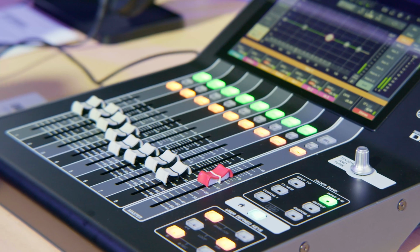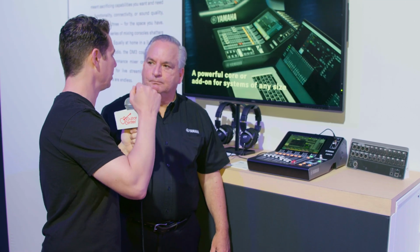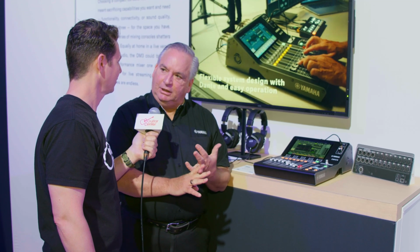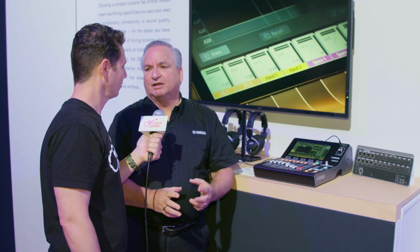And so, what are we dealing with in terms of the key stats on numbers of mixers, numbers of sub-mixes, numbers of effects, things like that? That's pretty easy on this guy. It's 22 total inputs. We're counting 2 stereo effects returns, and we're counting the USB right here on top of it for recording. And then we're also counting all those analog inputs on the back. On the output side, the architecture of the console is 6 Auxes that can be paired for in-ears if you wanted to do stereos. And then you get stereo, and you also get 2 what we call matrices, or mix of the mixes.